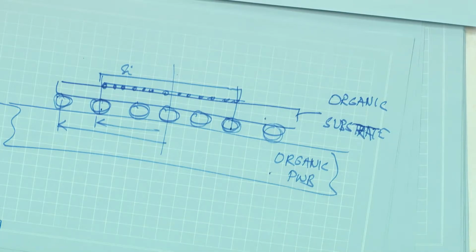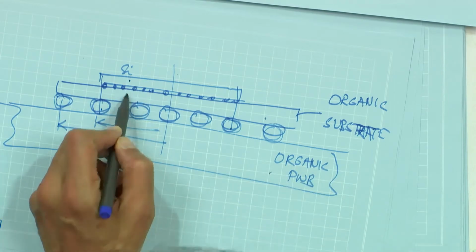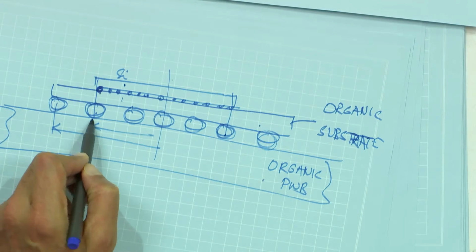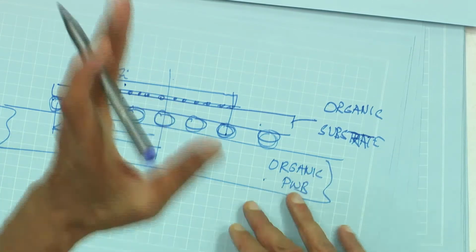Different CTE between the die. Say it again. The different CTE between the silicon. Right. And what is that doing? So normally you'd worry about the difference between them affecting these solder joints, right? The angle of deflection will be more towards, I mean, due to the difference in CTEs, there will be more deflection here. Okay. So I think you're onto the right answer.